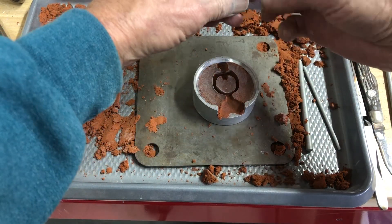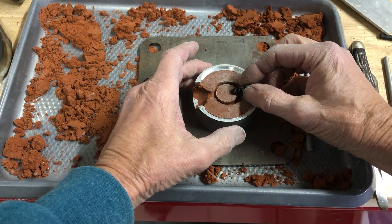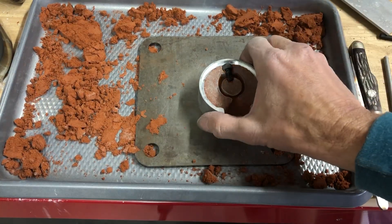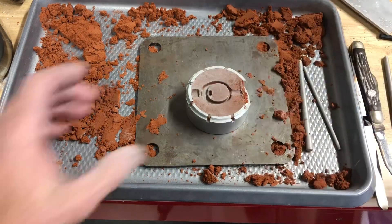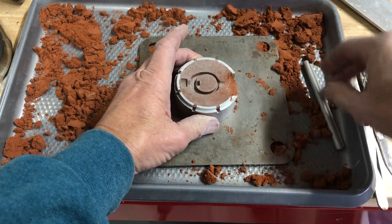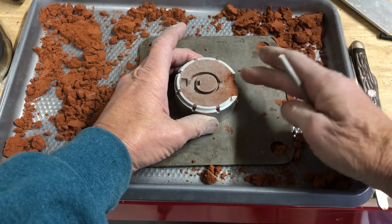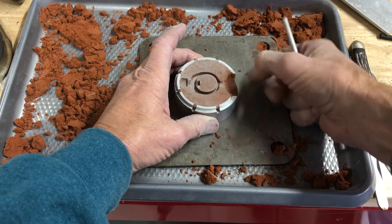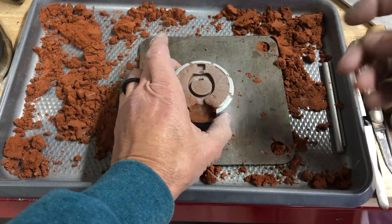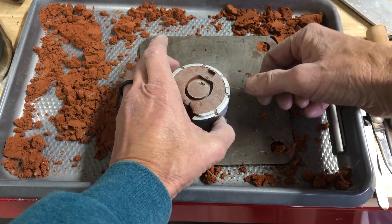So what I'm going to do now is take this, unscrew the bolt, and place it right in there just like that — and that's actually going to stay in there through the whole cast. Now we'll set that aside, take this one, and do the same thing — use our thumb just like that. I like to round this off so that there's nothing sharp that could break off when the molten metal rushes in. Kind of clean this off right here, and then we need to create vents. Sometimes I've done these where I just put two vents in, but I'm going to put them all in.